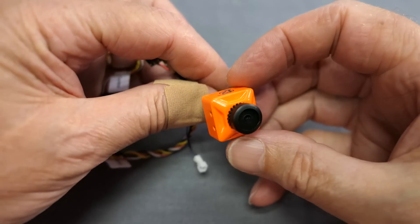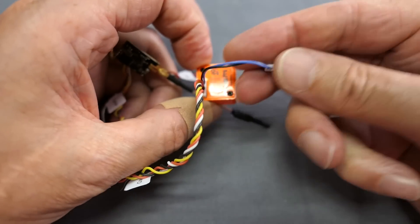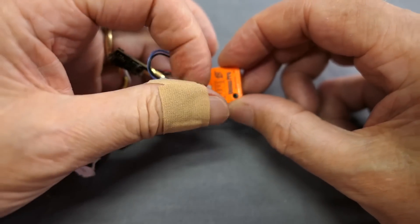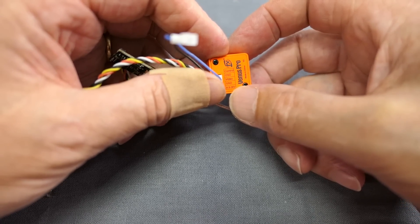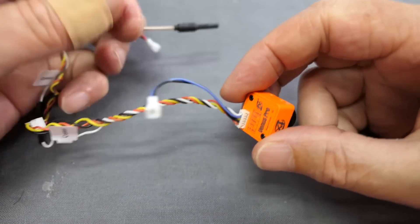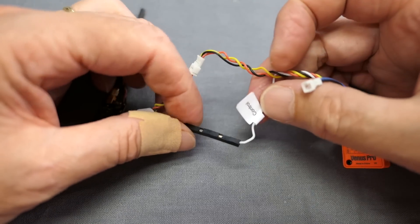Here's the little Venus Pro camera with an M8 lens, 16:9 aspect ratio, changeable. There's a little pigtail for the keypad for changing and setting up the on-screen display. It runs from 4.8 volts to 36 volts for the camera — ground, video, on-screen display, and control. That used to say 'power' in the previous Venus Pro. That's the smart audio cable — they're calling it 'control' there.